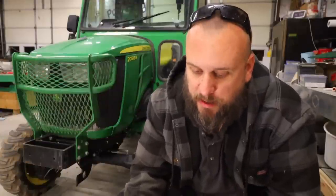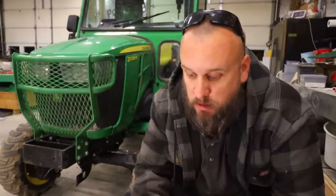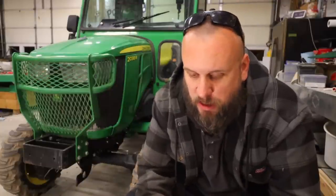This is once again talking about warming up the engine. After it's started, set the engine speed control lever to one-half fast position for one minute without load to warm the engine — they're saying warm up your engine at half throttle, and it only takes a minute. One YouTube channel I really like — smart guy, more experienced than me — made a comment that he warms his tractor up in cold weather for 45 minutes so all the fluids have time to really warm up. I thought that was pretty extreme, and it seems like you can warm the tractor up in just a couple minutes from what I'm reading here.